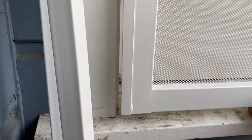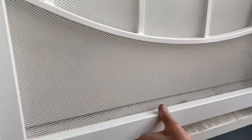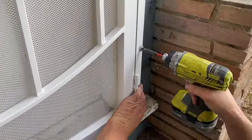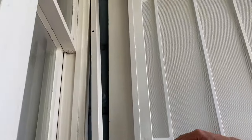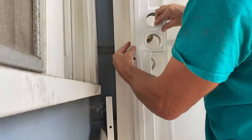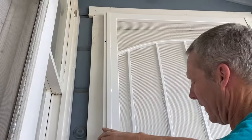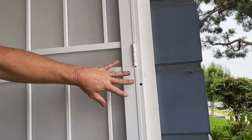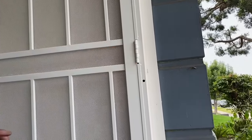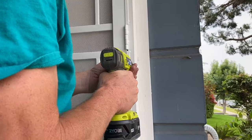You see, we're gonna move it right over to there. Does that look good? Mm-hmm. Okay. Put in one of the screws. Now that we're lined up there, see, I just hold that in place. And I know the door is gonna work, and I know we're up high enough. Not gonna put this thing on yet. We're gonna get this secured. So now that this is held in place, we wanna get this side anchored before we put in the strike side. So I'm gonna drill this out.